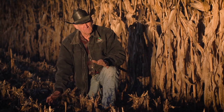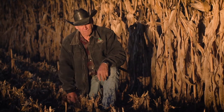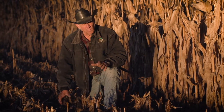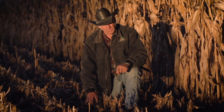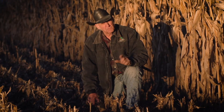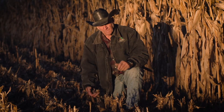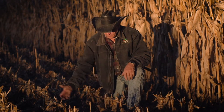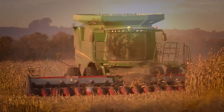The people that have trouble with leaves and trash blowing off and filling the ditches is primarily because they've used some of these surface tillage tools that lay everything pretty much flat on the ground. Or even if you use the lawnmower blade type choppers that are on a lot of the factory heads, they leave only two or three inches of stubble — it's like a little iron rod to run tires on. It's not tall enough to catch the leaves and hold them on the field, and they end up blowing off into the ditch.